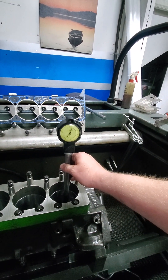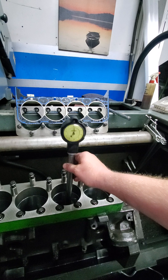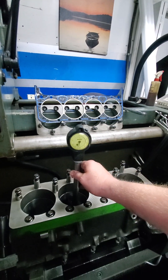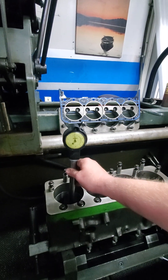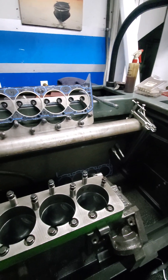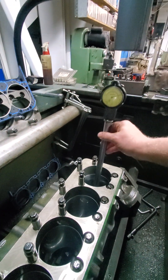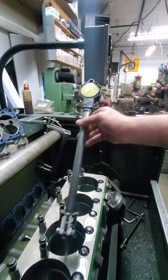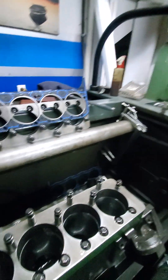Okay, we stayed zero. Half thousandths in the middle, another half thousandths near the top. Two tenths small, seven tenths small, six small. Three small, three small, eight-seven-ish. Four, six, three. Alright, so it moved in this direction - everything got tight. We could go sideways but I didn't show you the before, so that's probably irrelevant. Let's say we went four, four, four over - I'm talking ten-thousandths here - three over. That one stayed zero. Looks like a zero.